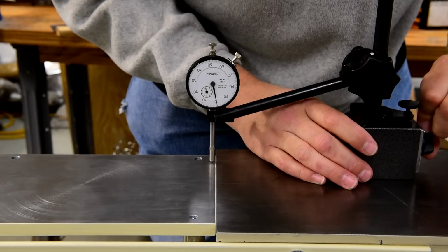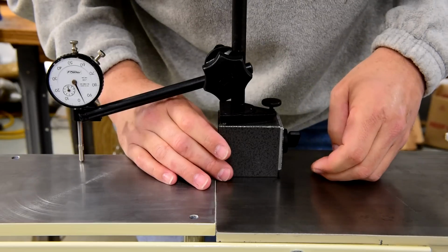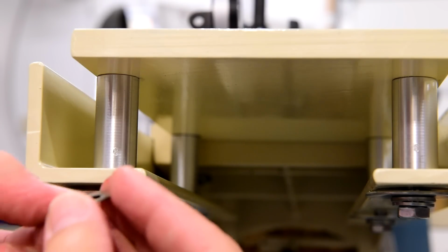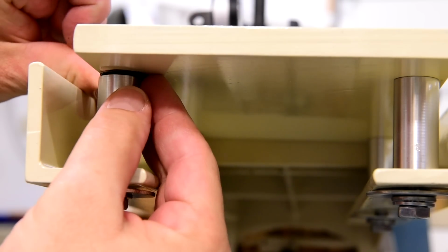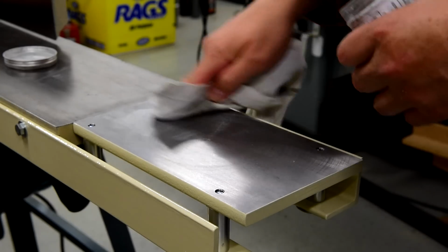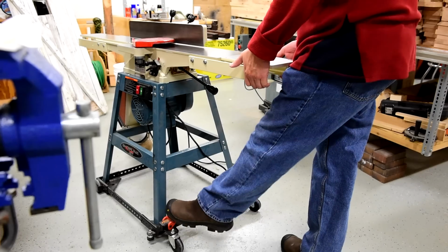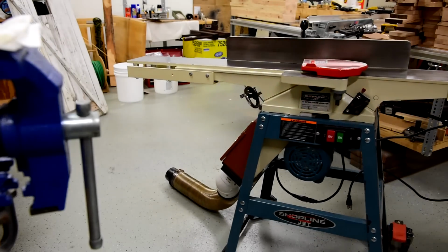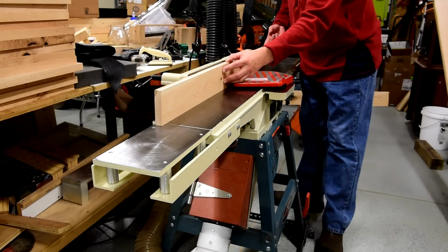Now I'm getting pretty close to having the plate accurately aligned, as you can see here, but one corner is about 3/1000ths of an inch too low. I made some shims to shore up the low corner. And a final waxing to ensure good coverage. One nice thing about this style of extension is that I can move the lathe without having to readjust anything. A test to check how accurate it is.